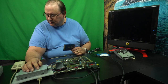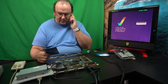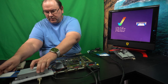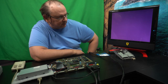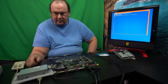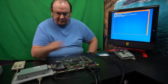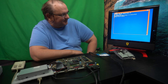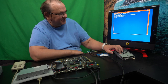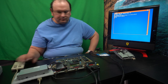First time I'm testing it. Okay, so at least we hear clicks, and it actually searched for track 0. Let me get this here, so standard 3.1 Workbench, see what happens. A little bit of a warning, I actually did have a load problem. I've been using this disk a bit too much, so let's not panic if it gives one read error. It's not the drive, it's the disk. I've been testing other Amiga configurations with it in disk drives that are in even worse condition than this. But it seems to be loading okay. The mouse works.